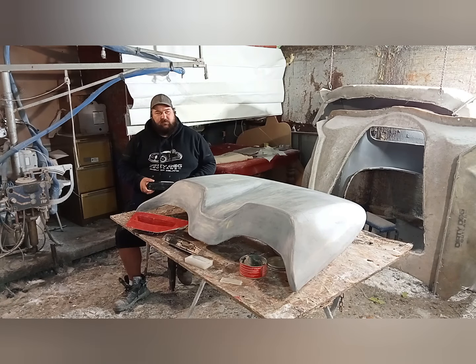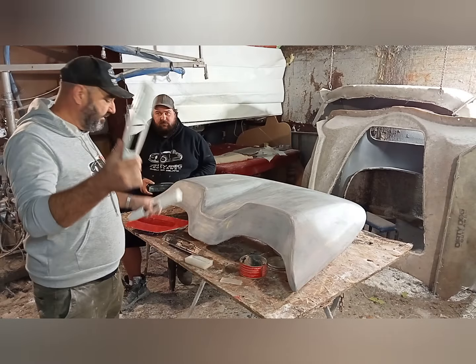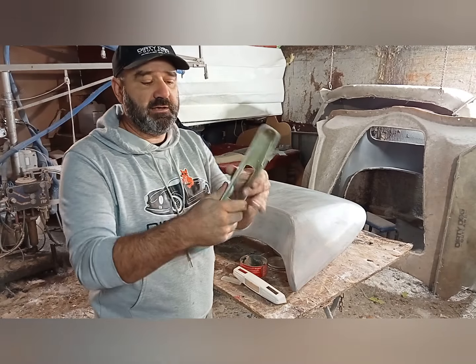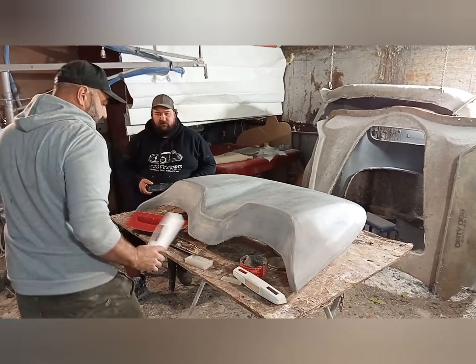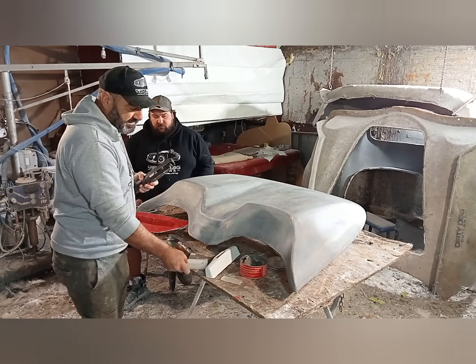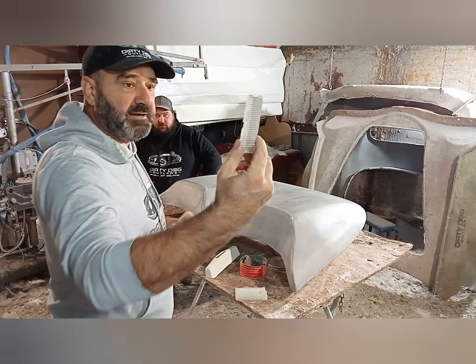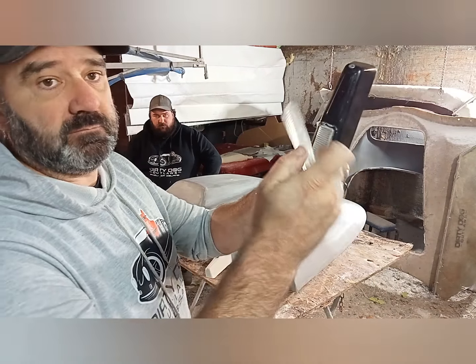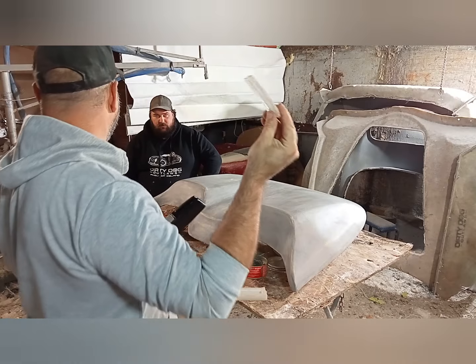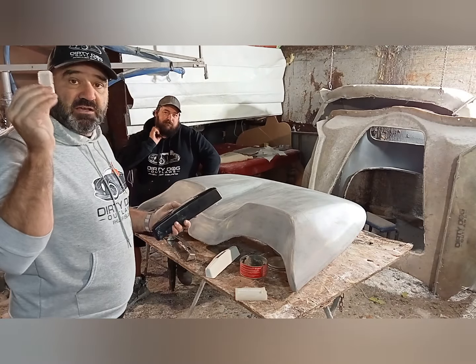So these are the casings. We make them out of fiberglass. That's super, super strong, look at that. And then, this is what Davo's done. Then we made the silicone molds. That's a silicone mold and epoxy resin, the lenses. So the epoxy resin lenses. That's exactly what we've done.